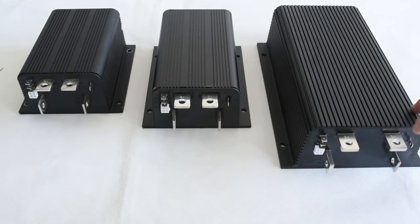On the right, you can see it's a big one. This is the new 1221M-series controller from Curtis. This controller has a very powerful output. It can work with 48V, 60V, and 72V, up to 80V DC power systems. Theoretically, it can drive a DC motor of up to 15kW, so it's very powerful — it can easily drive forklifts.